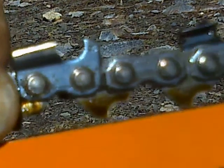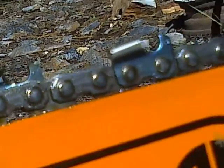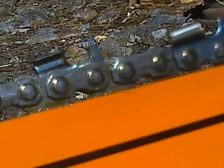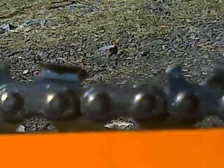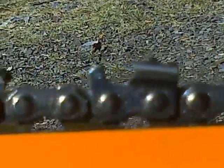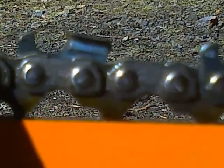And if you look very carefully, you'll see that it tells you how wide the track is running around the edge of the bar — 1.6mm, or 63 thousandths of an inch. And that matters because the tang on the chain which goes into the groove has to be the correct size for the groove. Otherwise, if it's too narrow, the tang is going to wobble side to side in the groove.